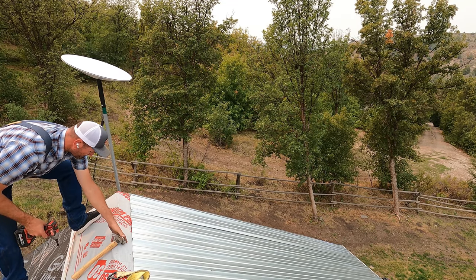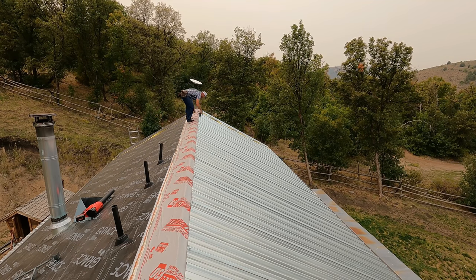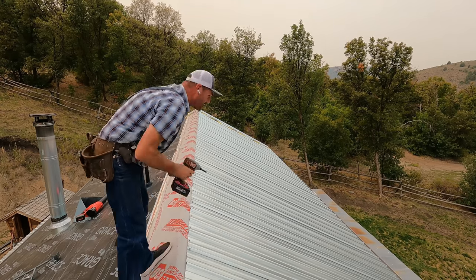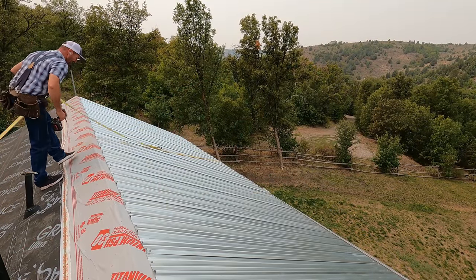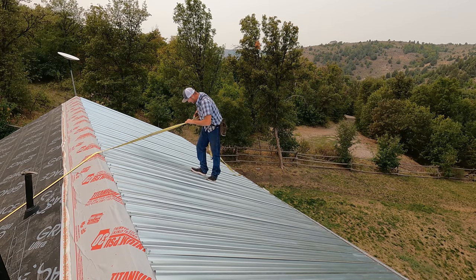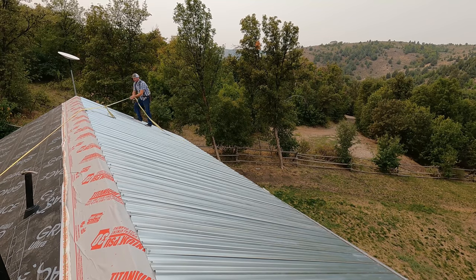These panels do have a little bit of give and take, like an accordion, although nowhere near that much movement, but just enough movement to get it lined up on the bottom and on the sides, which naturally looks perfect when the line across the bottom is perfectly straight, but also the line up the rafters across the front of the house also has to line up. On this front side, because there are no vents or chimney or any other obstructions, it was very easy to get this done.